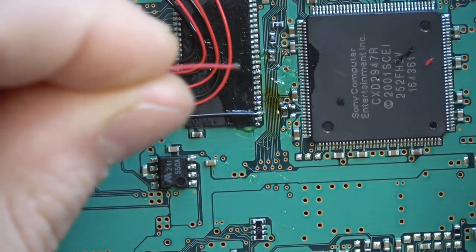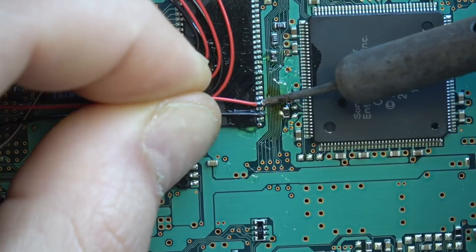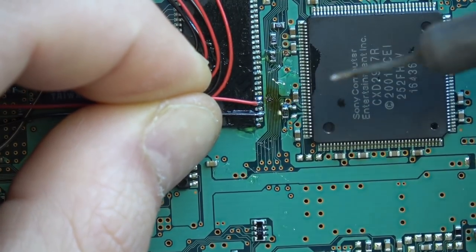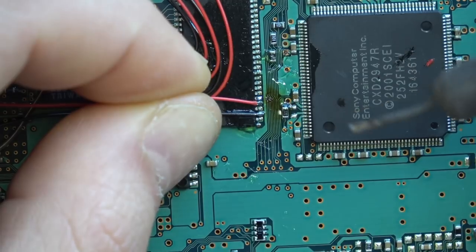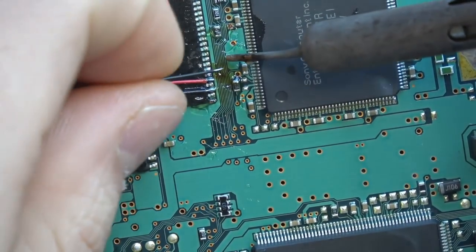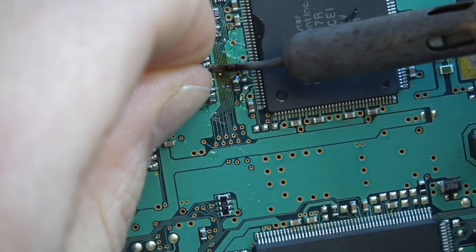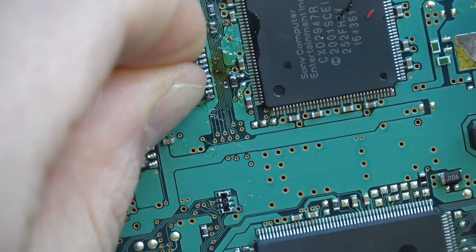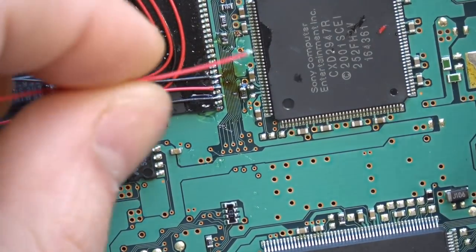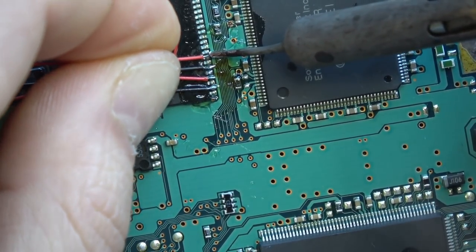Back to it: tin up our wires, put them in place, and just give a gentle press of the 3mm chisel tip right down on to where it goes and you're done. I'm going to do that two more times to finish this chip, then get all the other solder connections on the board done, and then we'll focus on wire management and how to make it look nice.